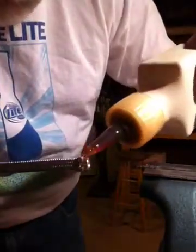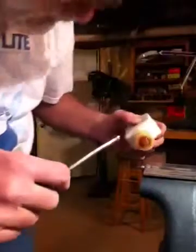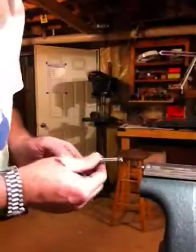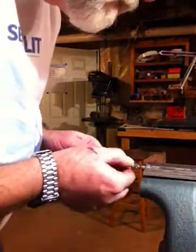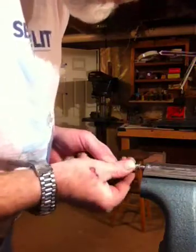We'll put a little bit of lubricant on the stainless steel and the brass collet, and lubricant on the threads of the connector. Push it on and make sure it goes on solidly, holding some pressure to make sure it stays on there.